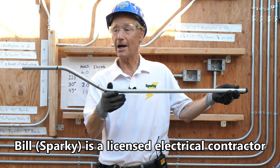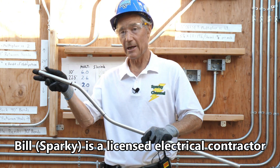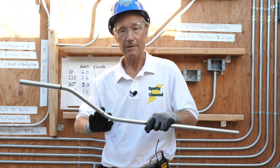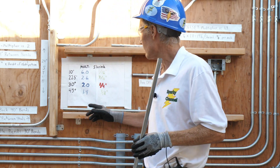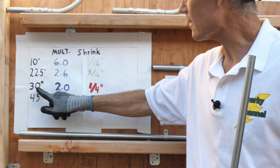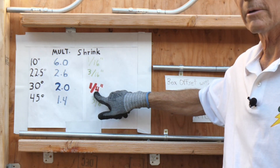I first cut this at 40 inches in length, and then made the bends. But if you like, you can make the bends and then cut the conduit — but you need to know about shrinkage. For 30 degrees, the shrink is 1 quarter inch per inch.